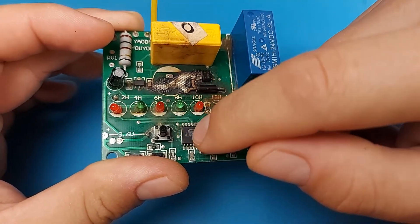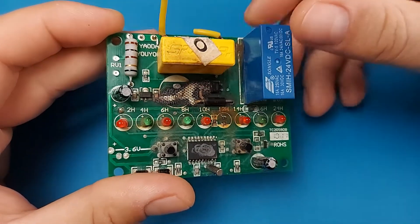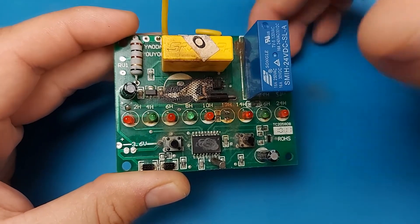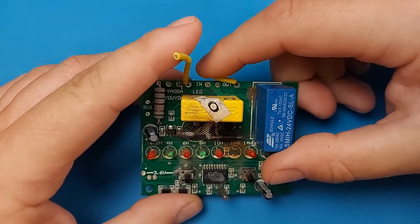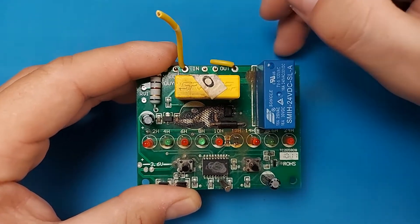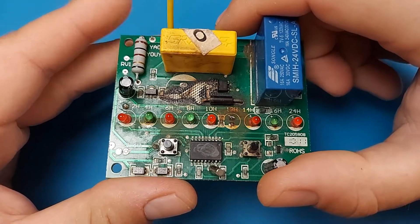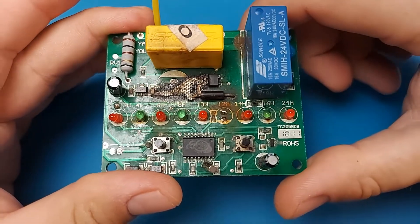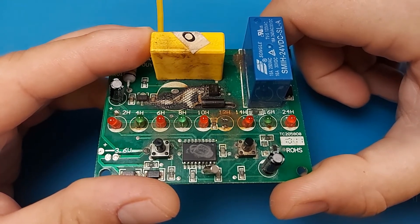Knowing that this is a PIC microcontroller, we could probably buy a replacement, program it, and rebuild the whole thing, but it's really not worth the effort. I've already talked with my friend and the idea is that he will replace this controller with one of those programmable timer circuits that you can buy and hook the motor directly to it. Now he's just completely bypassed this board and running the pump directly from the mains; using that timer he can program it to run for a specific period of time as he wants. That's about it for today — I hope you managed to learn something following my adventure to see what went wrong with this pump controller. If you found that interesting, subscribe and check some of my other videos, and I'll see you all in the next one. Cheers!